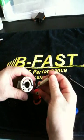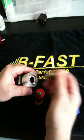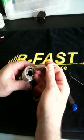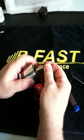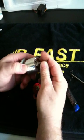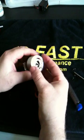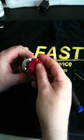The most important thing to do when you reassemble this motor is to have a firm grasp on the rotor. You do not want this to slam down and bang the sensor board inside. What I do is hold it really firm and actually move the can into position and let it seat. Once I do that, it'll wiggle and you usually seat it right down and reassemble the motor. Do not forget to put the phenolic plate on there — it's very important.